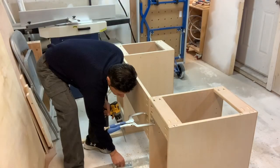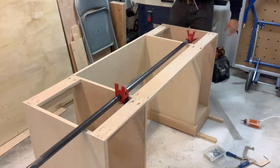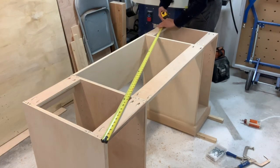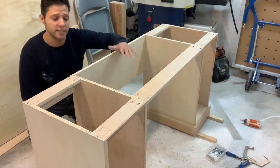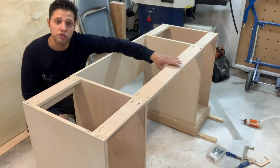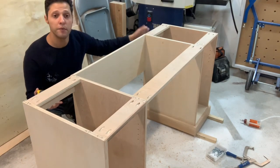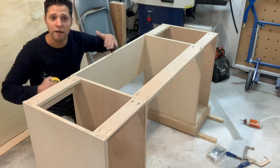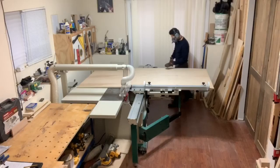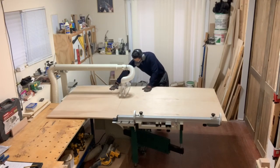With both carcasses standing at the distance I need, I'll install the rear stretcher stabilizer and then the front stabilizer. I've checked the diagonal and the case is completely square. This stretcher brace will not only give support to the top, it will also keep everything completely square and prevent the sides from splaying out since there's nothing holding the bottom. Once the top is installed the whole thing becomes one solid unit. Now I'll cut the top, which is going to be plywood with red oak edge banding mitered all around it.